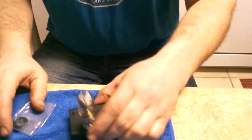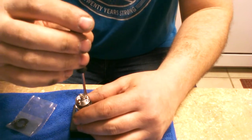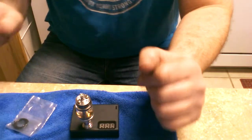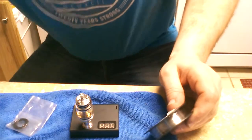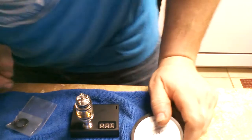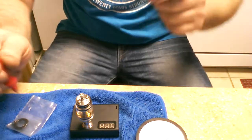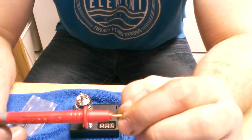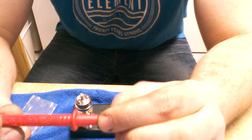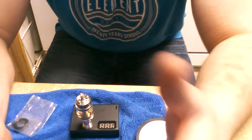Hopefully we get you all nice and straight. I'm gonna loosen up the center post — the two negatives just a hair, doesn't need much. I'm going for 0.6 ohms. I'm thinking 28 gauge Kanthal, eight wraps — two micro coils, eight wraps each of 28 gauge Kanthal. There are quite a few videos on auto dripping mode out there, so this might sound familiar — I'll try to describe it well enough.